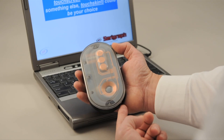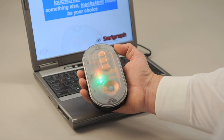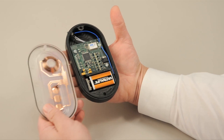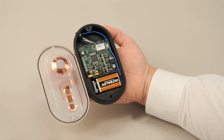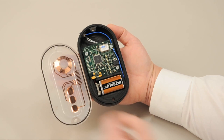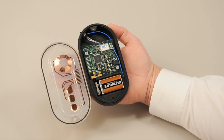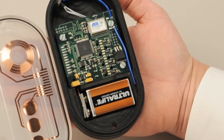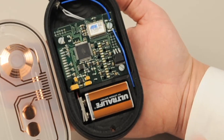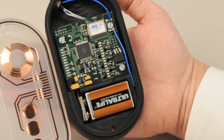So how does it work? Not to be confused with a touch screen, Functional IML utilizes a substrate with a copper circuit. This substrate can be insert-molded with a graphical overlay, creating a robust functional interface. This integrated part with its capacitive sensor circuit is connected to a printed circuit board, where a microprocessor and other electronics drive the circuit and convert the touch inputs into product function. Functional IML is compatible with Atmel and other major capacitive sensor chipset manufacturers on the market.